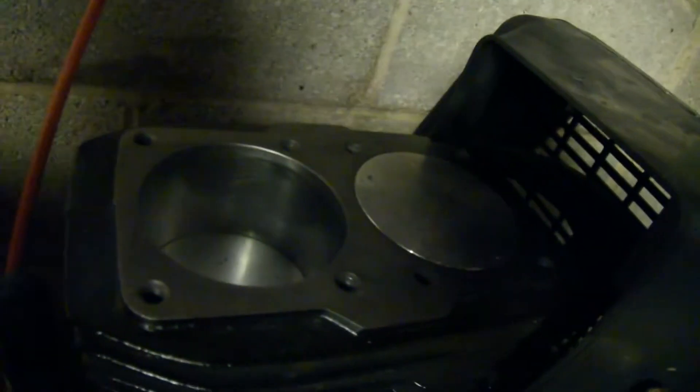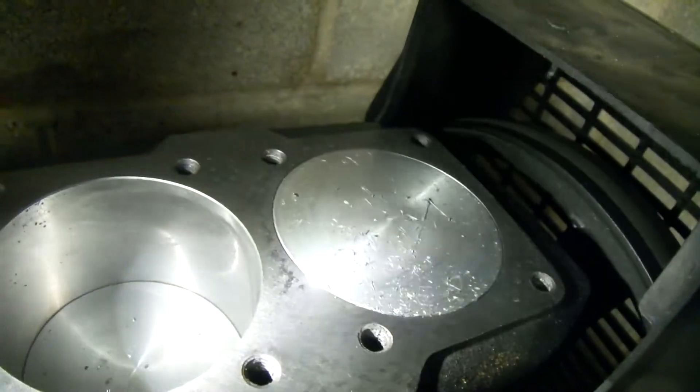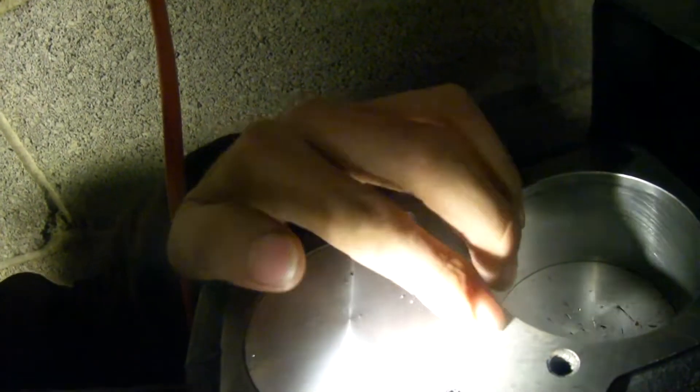Making compressed air — when these crack, the reed's gonna fall out or parts of it will. Imagine you dropped a valve in your big block Chevy: parts are gonna hit each other and things are gonna get all mangled up. You can see all the dents and dings in the tops of my pistons from where that reed smacked it a bunch of times. The cylinder wall seems okay — doesn't look too scratched up or scored. So what I'm doing is just cleaning this head off and putting on the new head and new reed plate they sent me.